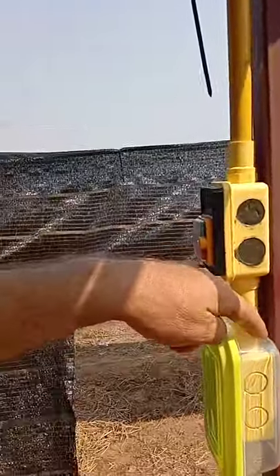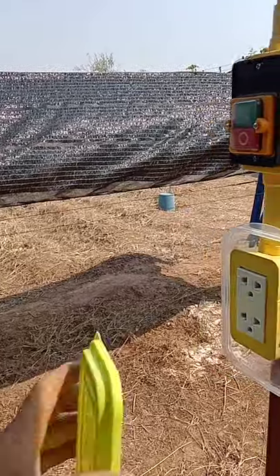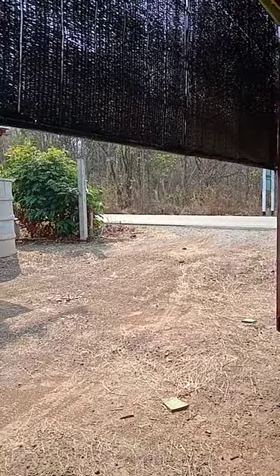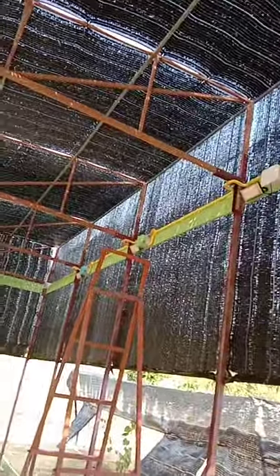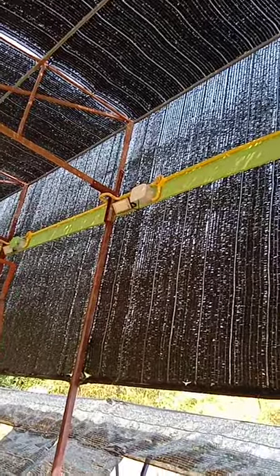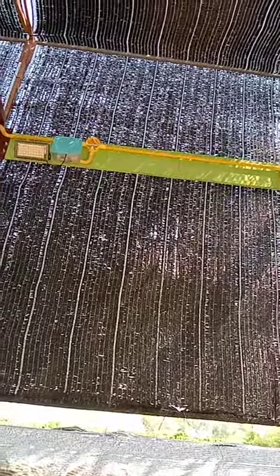This switch is weatherproof. Even though it's weatherproof, I'll still put silicone around there and around there and around there. I'll put silicone around the top there where it's got a bit of a gap. That's a power point in there, and there's one exactly the same over there. If we need air pumps, it gives us power that's down on ground level. Those power points are okay up there. I thought I'd better put them in now rather than stuff around later, because we need one cable for light and one cable for power — best to put it in now.